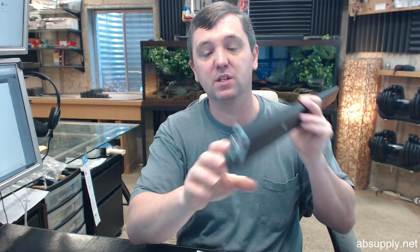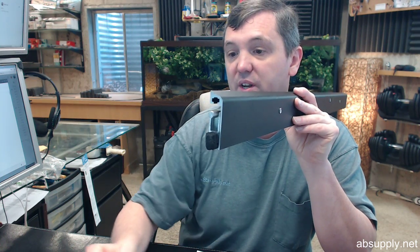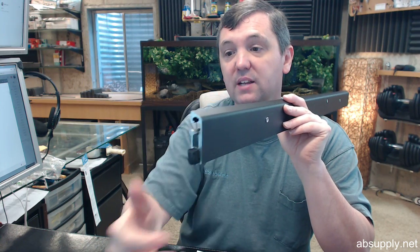Moving on in the extended description — this is made of aluminum with a dark anodized finish, which is where the DKB comes in. 220 is representative of the profile and type of unit. The N means the insert is neoprene versus silicone versus WH for bristle. Then you have DKB — dark bronze anodized finish. If you wanted a different finish like clear anodized aluminum, it would be an NA type finish.